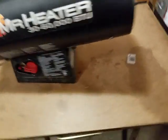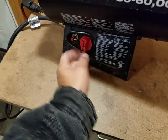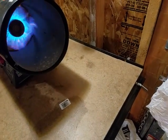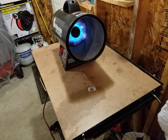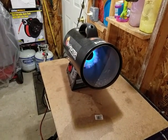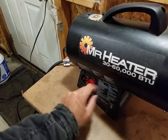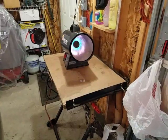I didn't count but that was about 20 seconds. I'm going to hold this igniter down. I have it on the lowest setting right now — when you turn it up, that's the highest setting. I'll start it on low. There, you can see it started — I'll hold it and there you go. So this is on the lowest setting. Now I'm going to put it on the ground since that's normally how I use it, and I'm going to turn it up all the way — 60,000 BTU. It doesn't have any indication to show what's in between low and high.